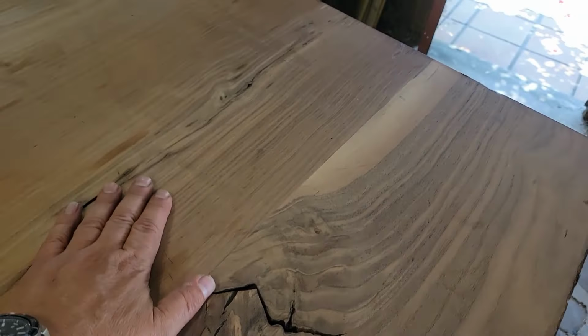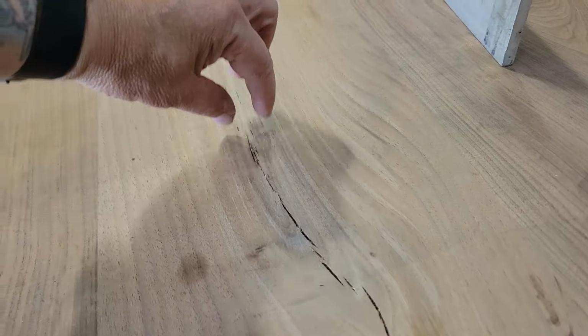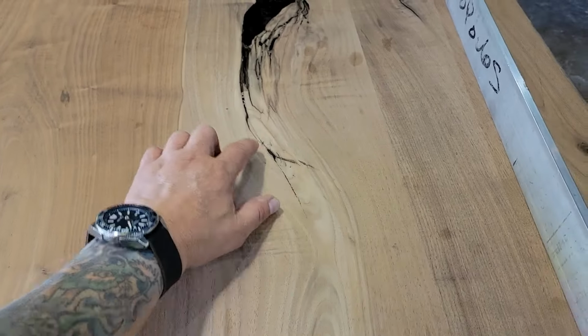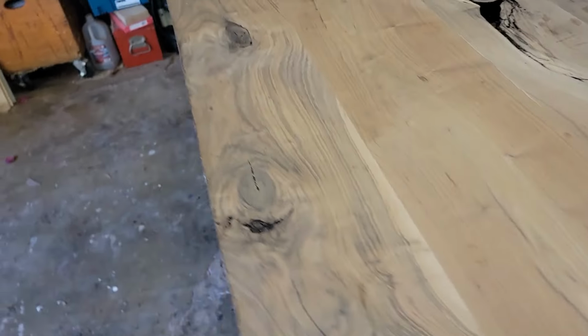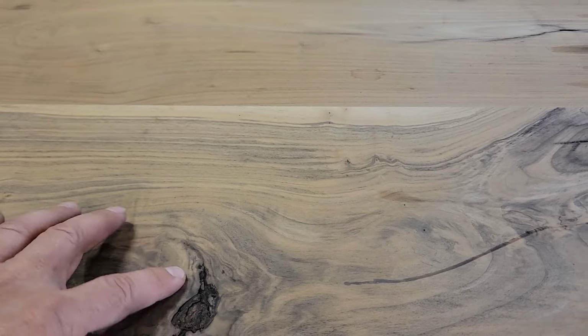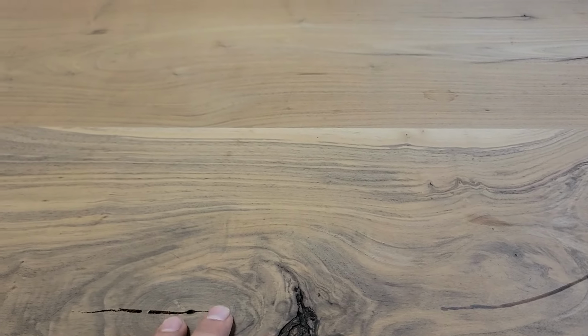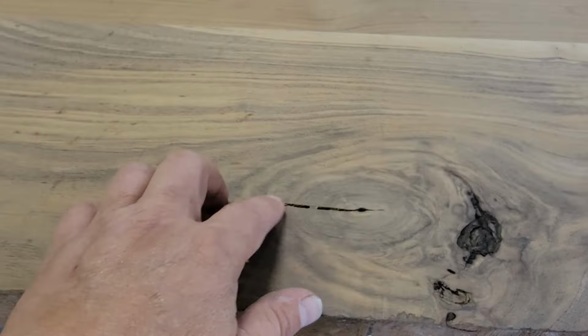I'm not going to do them like I normally do, where they're all the same. I'm going to make them all different, but I think I'll just use Purple Heart for everything. I'm going to put a couple here, stitch this seam together. I'll put a couple here, boom, boom, right? And I'll probably do a Dutchman patch right here because you really don't want this right where somebody's sitting. So I'll do a Dutchman patch here. Maybe I'll do a Dutchman patch here. I'm sorry, you're off camera. And a butterfly there or something.